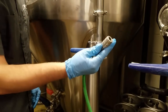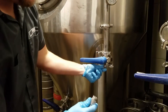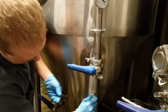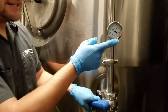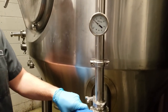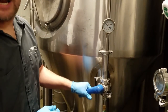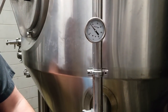Before fully hooking up the CO2, I give it a couple pops because there's a little bit of O2 trapped in that spot — so pop it a few times before fully connecting. I like to keep my tanks when they're cold at around 10 psi. Tanks will usually lose a little psi, so it's good tank management to bump up your tanks every day or two to make sure they stay under pressure. Let's go ahead and get this FV6 up to around 10 psi.